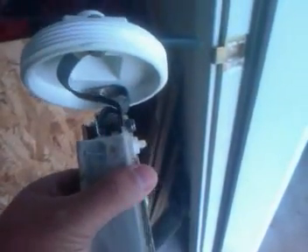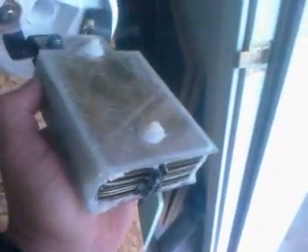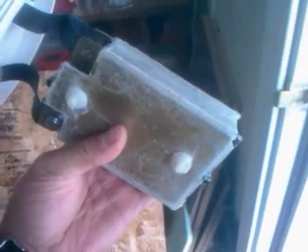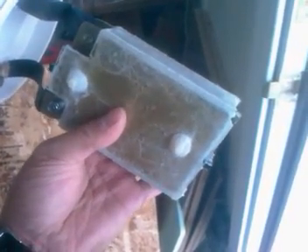The efficiency goes down when I bump it up to 15 amps, again with the pulse width modulator — down to about 3.7, if I remember correctly. Hydrogen production did go up from 550 to 600 roughly with increasing amperage, but still very far from where I need to be. But I like the design. I like the idea of the brick. I have a funny feeling I'm going to make a brick design, hopefully keep it this small, and it'll do a lot better job of getting rid of the extra heat. I like MagDrive's idea about the bricks — I think they probably stay a lot cooler. If I can put my radiator in there between this and my reservoir, that may be the thing to do to keep heat down.